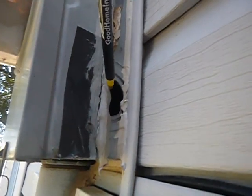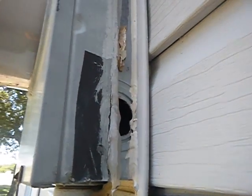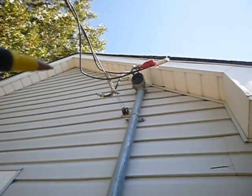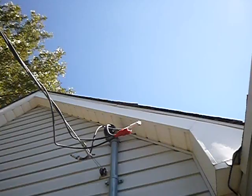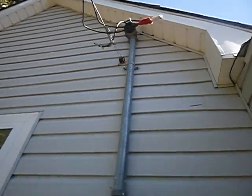This meter has a mounting block. We have an open knockout inside the meter box. You think water can get in there? I do. This weatherhead, okay, it's not supposed to terminate below the roof line. It's supposed to extend 3 feet above the roof line. It's not. I have a still image.